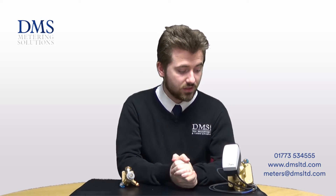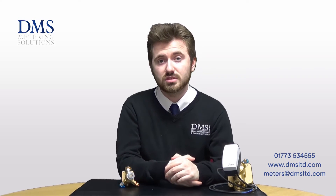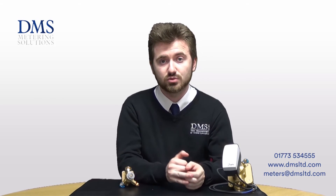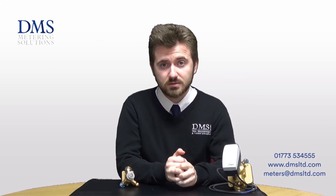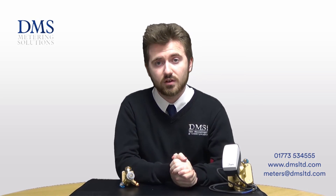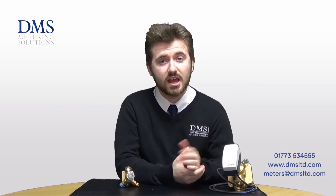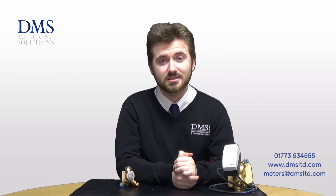These actuators give the valve more control over the pressure and heating involved, and the AVQM can be used as a PICV for installations such as air handling units and fan coil units, with full authority. Thank you very much for watching — should you have any questions, get in touch with us in the office or in the comment box below. Please give the video a like if you found it interesting, share it so others may find it as well, and please stay subscribed for future content from DMS.